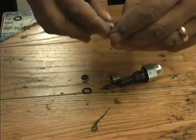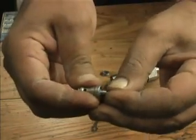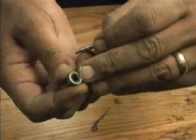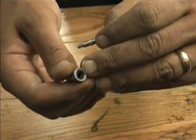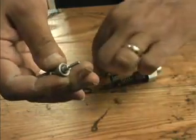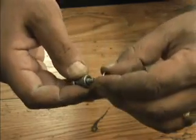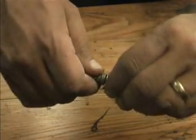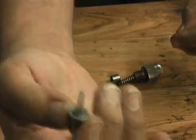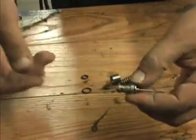Let's start it all over again and show you. Pulling this apart — there's our glide ring on the poppet, and there's our O-ring in the recession around the end of the poppet barrel. Insert that in there, then use the washer with the raised portion facing in to push the glide ring into place in the center of the O-ring. That's the most difficult part, because if there's oil on it, it keeps popping back out.